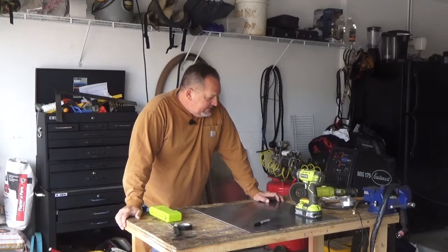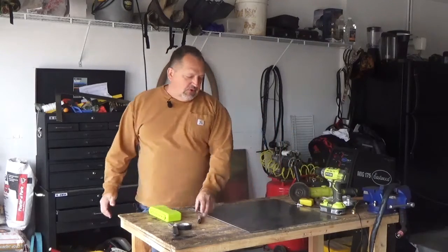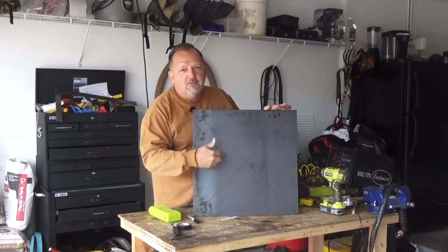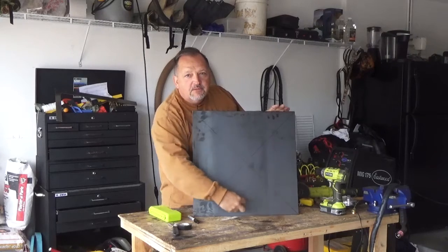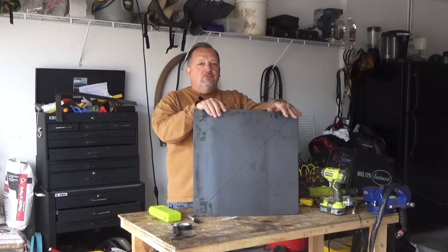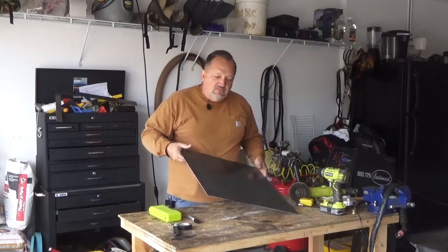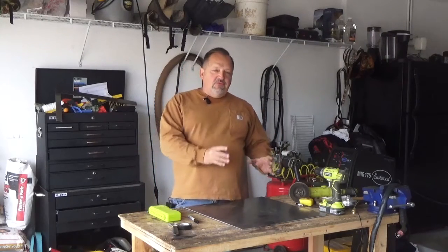This will be where I take some sheet metal — it's 1/8 inch thick, 20 inch by 20 inch. I've got a cross on the center of it. I'm going to draw a little hole there, and then we're going to take the plasma cutter and cut out the same diameter as the end of the trommel tube. Inside that there's going to be an 8.5 inch diameter hole where the tube that feeds the slurry into the trommel will set into.